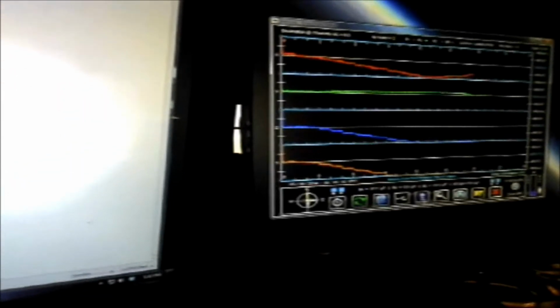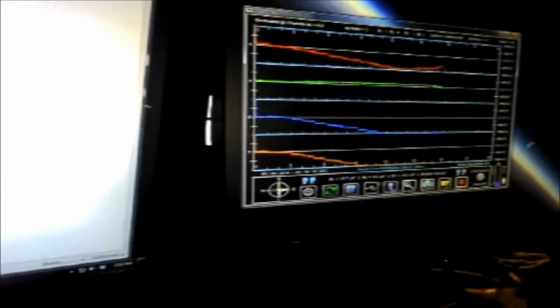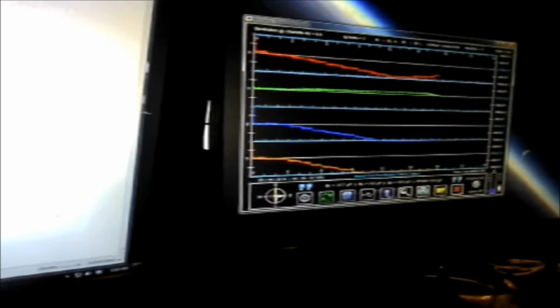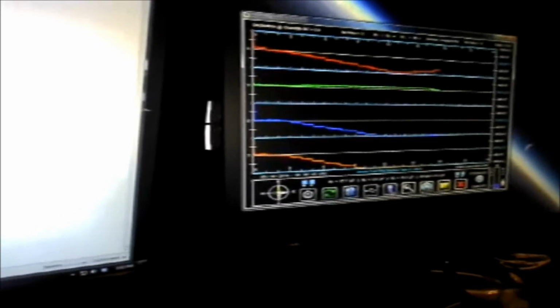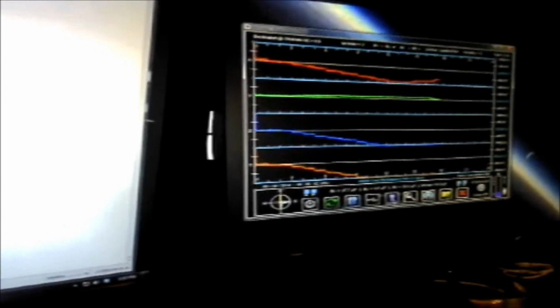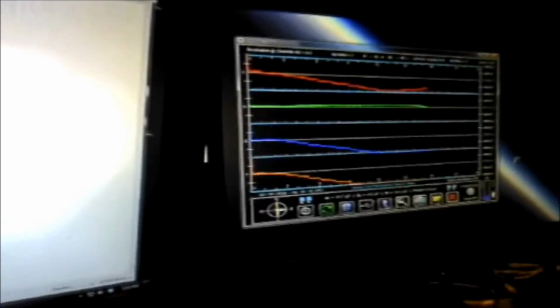So when I go to plot this, it's going to be much like the digital magnetometer, but I'll be measuring much more precisely, on the order of a few nanoteslas and change, without having to use averaging and oversampling. I'll probably be able to take one reading, and that should be accurate enough, or maybe average 3 readings at the very most. But to compare the little algorithm that I wrote to determine field, I'm going to use absolute values.